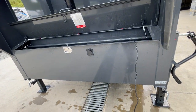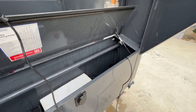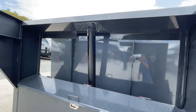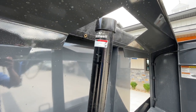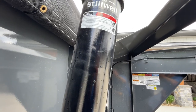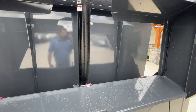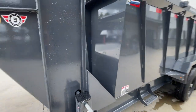The toolbox is lockable. The lid has gas shocks on both sides. Now, this has a telescopic hoist upgrade. This is a Stilwell hoist — a made-in-the-USA setup. It's an oversized 4-inch by 144-inch cylinder, a 12-ton setup, very heavy-duty. Not the cheapest cylinder in the market, but it is a good one. Eagle is another common one in the industry — that's a Chinese hoist we've used on quite a few trailers with good luck — but this one here is a USA Stilwell.